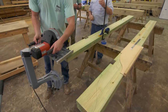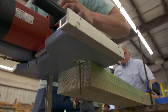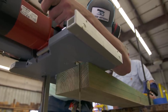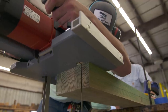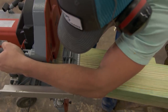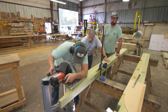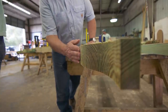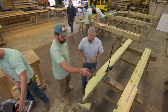We have a few of those ends left to cut. He's using a portable bandsaw — it's a portable bandsaw, so you can do some end profiles. It has a table like a circular saw would have, and you just work the tool around the beam rather than the beam around the tool. They can be tricky to use, but that saw does a nice job.